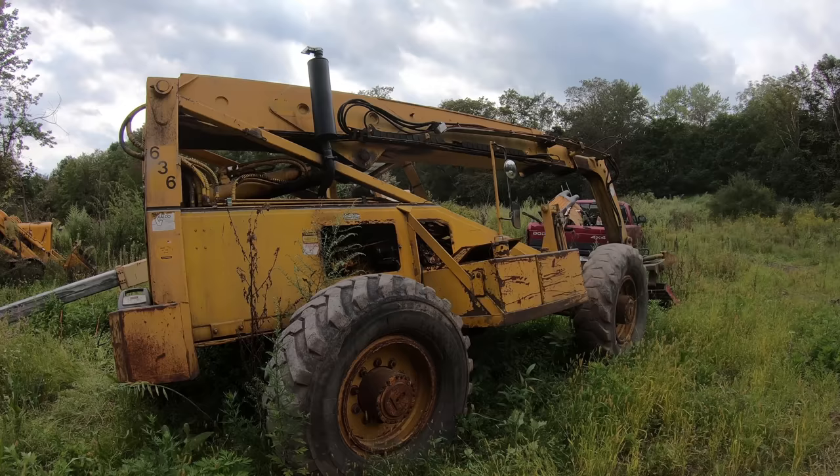All right, so this side isn't so easy. You can see I bent it pretty good. I'm kind of afraid that because I'm underneath of it while I'm doing this, the more it bends, the more it's gonna go sideways and it could hit me in the head or something. So what I'm gonna do is gouge this weld out and put on a much stronger piece of steel. This is only a 16th inch, but I thought since it was so long that it would do the trick, but I'm gonna put something on that's like quarter wall.